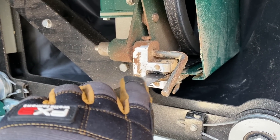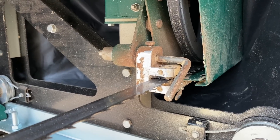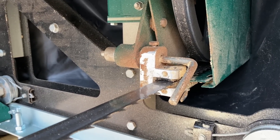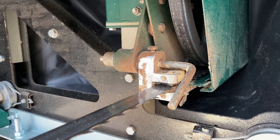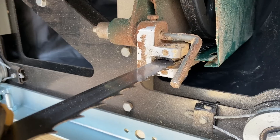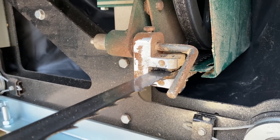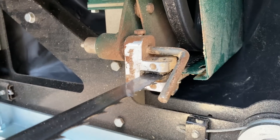These set screws need to be snugged down really tight. These blocks need to be tightened as much as you can to hold them in place. Once set and snugged up tight, I haven't adjusted these blocks for a couple of months through a couple of blade changes, and the clearance is still good. When those guide blocks are set properly, they constrain the blade from wobbling — essentially limiting movement to 20 thousandths up or down. Under nominal use there should be no movement at all, and the blocks really shouldn't be touching. But if you get into a wobble situation, that's what's going to keep you from a really big problem.